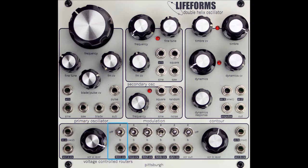I can choose to have the FM control voltage for my primary come from the A bus or the B bus, as well as this direct input. This direct input does not have any attenuators. The A and B inputs have a normal input, an input jack to override it, a VCA, and a volume control. There are also FM depth controls on each oscillator, so you do need to watch what you're doing to make sure you're getting the FM amount you desire.